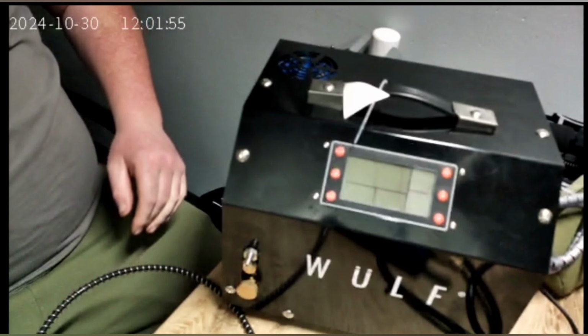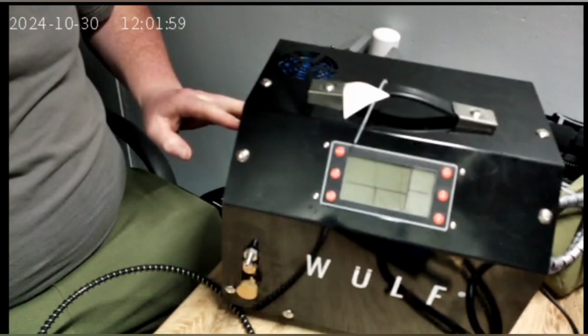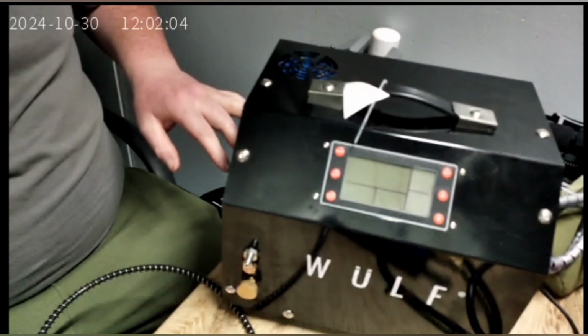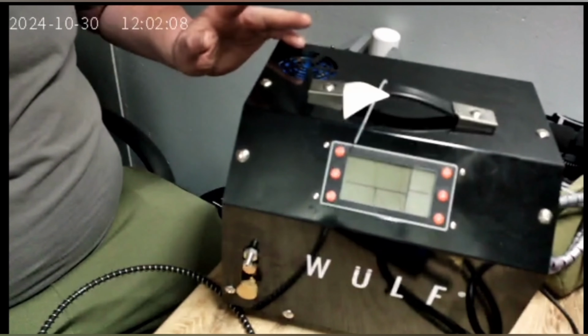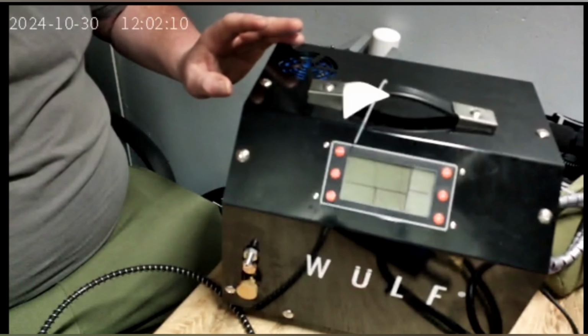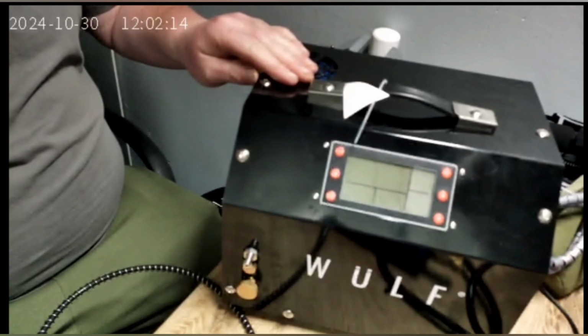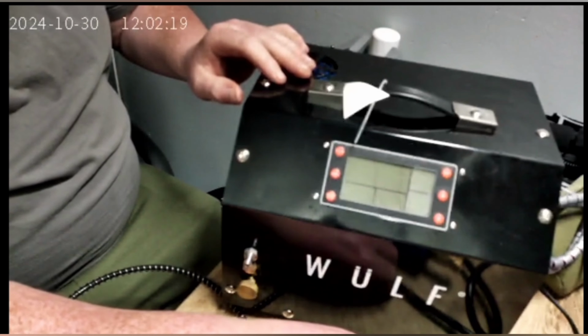So the first thing that you want to do with this compressor is there's a little hole in the side here. Now if you get this brand new, you want to put 3 drops of pure silicone oil in there. You do get a bottle of that supplied. That just basically keeps everything lubed up, everything running as it should. You get the instruction manual, obviously, which gives you tips for maintenance in there, what you should be doing, what you shouldn't be doing, that sort of thing.